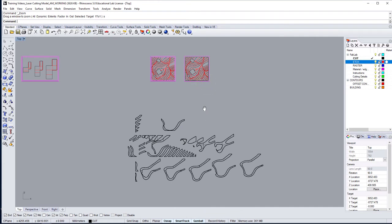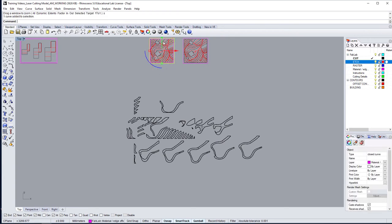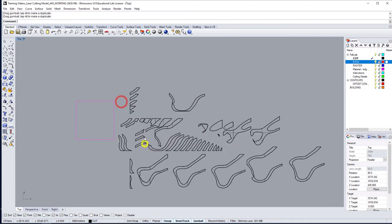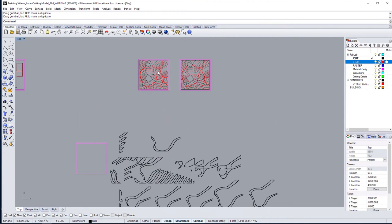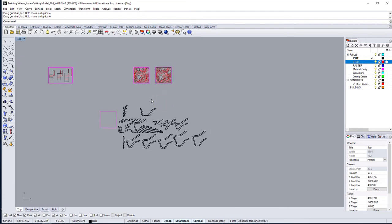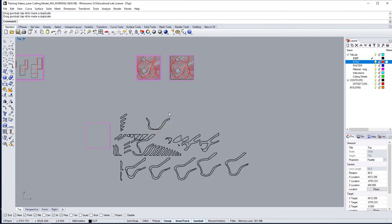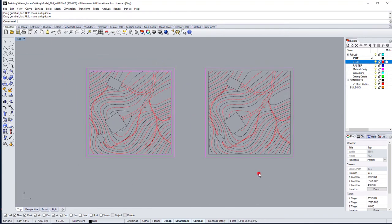For example, if we were to take our example project from the earlier chapter, the contour pieces could have easily been organised and nested as separate pieces, which would have required far more sheets than necessary, as you can see here. However, due to condensing each cut piece and minimising the amount of waste material on each sheet, this was consolidated to only 2 sheets of 600 by 600 mm MDF.